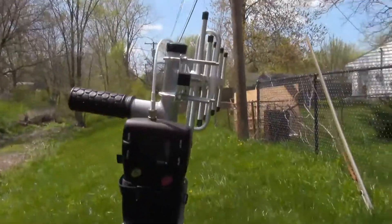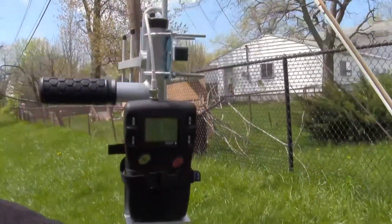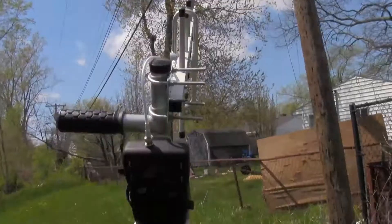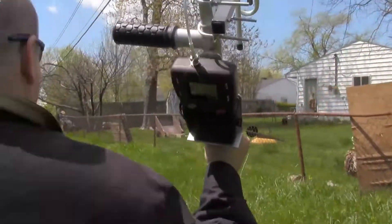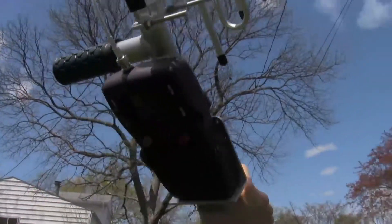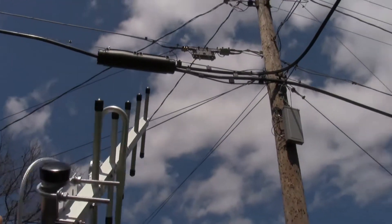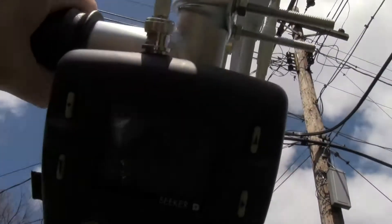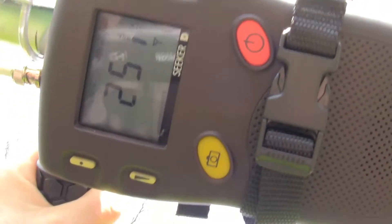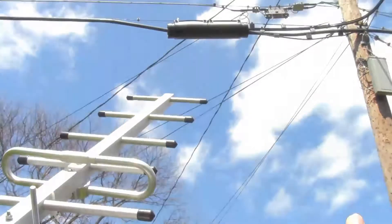As we go, I'm listening for the audible tone — as it gets to a higher pitch, it indicates a higher value of the leak. Now that I'm at the amplifier, we're looking at a 200-plus microvolt leak, horizontally polarized.